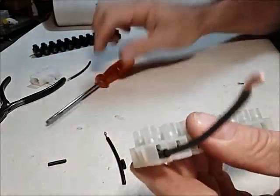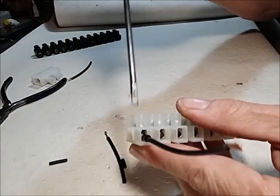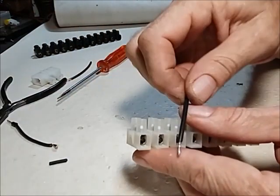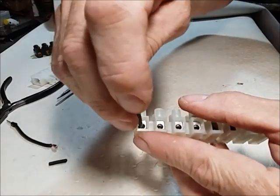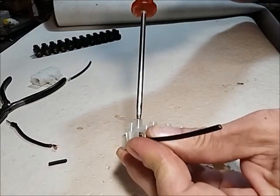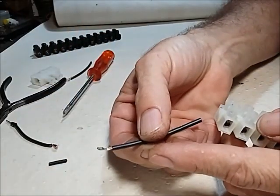The ferrule's little plastic collar also acts as a little strain relief. The next thing — and this is something I was taught — never solder a wire join when you put it in a connector block. Never go and solder the front piece before putting it in, because solder is flowable and after six months you will have a loose joint.